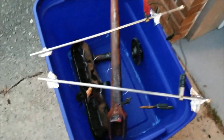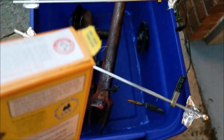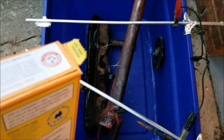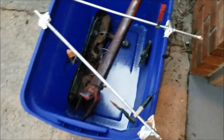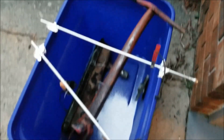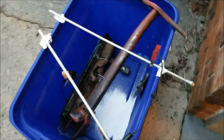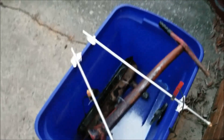Just so you know, I didn't invent this method, but I wanted to try it. I've tried molasses — I didn't make a video of that. It works really well but it stinks and it takes a long, long time. The rule of thumb I heard was one tablespoon per gallon. Or if you're metric, about 250 milliliters — which is a cup or so — that ought to be more than enough. This just makes the water more electrically conductive because regular old tap water by itself is not all that electrically conductive.